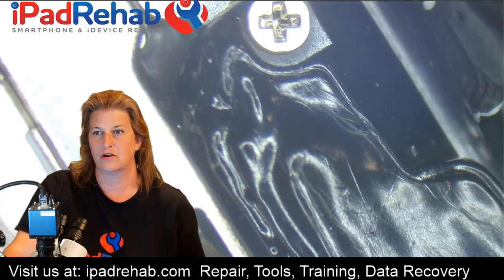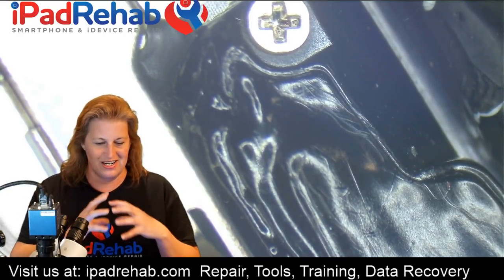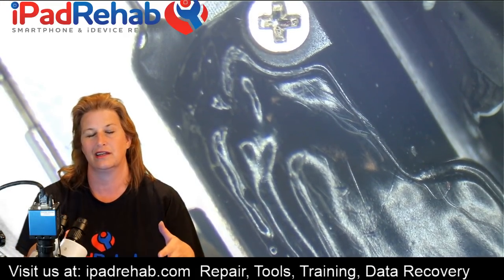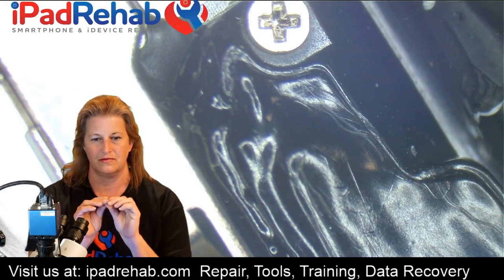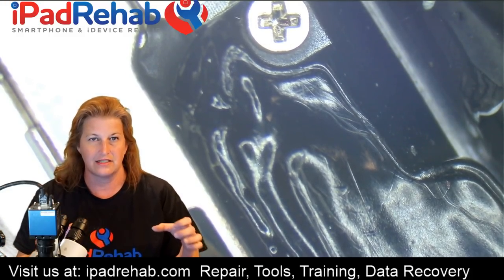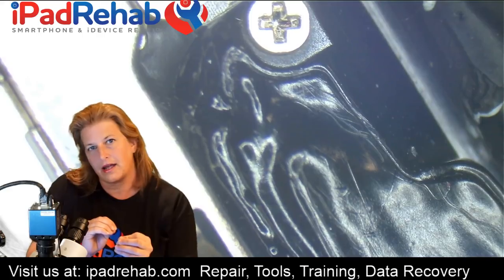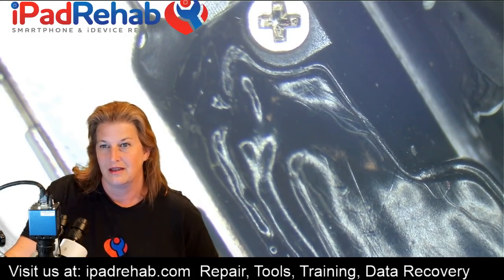There's no way you could clean a housing to make it look like it never had a battery fire. A battery fire will melt any wires or antennas — just the insulation gone with the wire intact, so they'll be like really thin little wires instead of a fat antenna — and there will be really broad, widespread obvious burn damage across a large area, not focal pockets. If you microwave a phone so that the battery catches fire, it would probably look really similar to that.